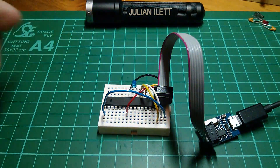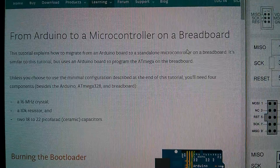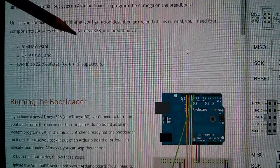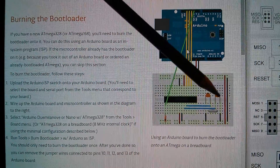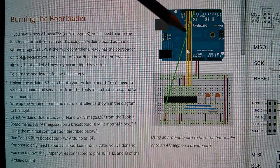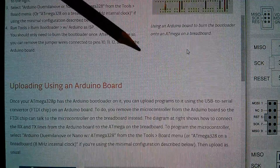Let's run up the Arduino IDE. I'm going to do this whole thing just from the IDE - I'm not going to use any other software. Now we need to look at this page called 'From Arduino to a microcontroller on a breadboard.' It shows the microcontroller on the breadboard with a crystal and the two load capacitors, but we're not going to bother with those. They're also using another Arduino as a programmer, which you can do, but I'm choosing to use the USB TinyISP programmer - it's just a little bit neater.